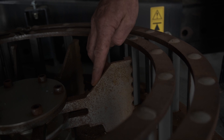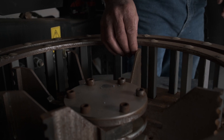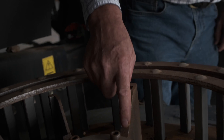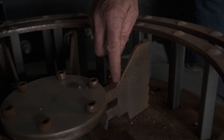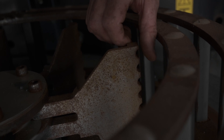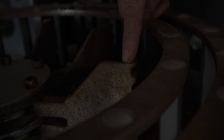These flails look almost new but again these have done a whole season. What you are going to see on a badly worn flail: this area at the top of the flail is going to thin and become razor sharp. This area along here will become razor sharp and roll at the top and it will start to undercut where it meets the base of the flail. This round corner is going to wear away from the top working its way down and will be very round instead of nice and sharp, and it may wear so thin that it starts to crack through this corner. That is the point at which you need to replace your flails.